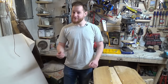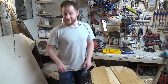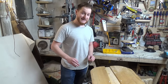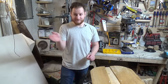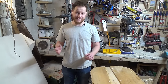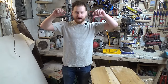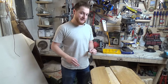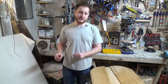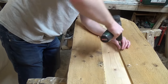Two days have passed now. The glue has dried and the piece makes a pretty solid impression. We can continue by refining the shape: starting with the edge grinder on the inside to make it more rounded, then the electric planer on the sides to straighten them and on the front for a more even thickness, and finishing with the orbital sander. Time for a montage — or as we say in Germany, Montagezeit. But don't forget to remove the screws first.